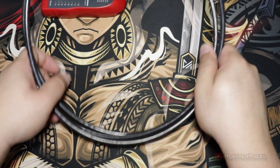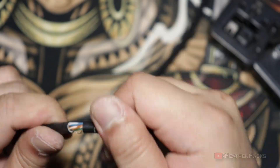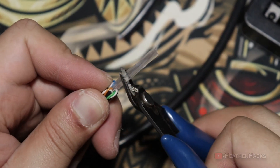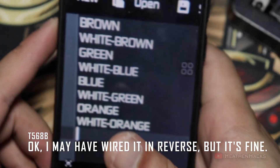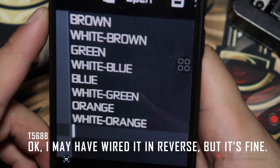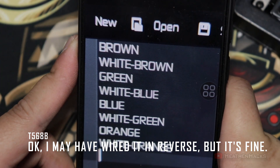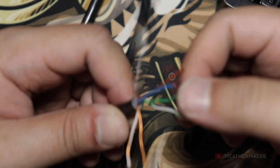This is the cable that we will use. I have already cut it to approximately 2 meters in length. First, we have to remove the sleeve, then separate the wires from the ripcord and crossfiller, and remove the ripcord and crossfiller. Next up is arranging the wires according to our preferred arrangement — this is basically how I have arranged all of the Ethernet cables that I have terminated personally. Let's separate the wires and straighten them up a bit.